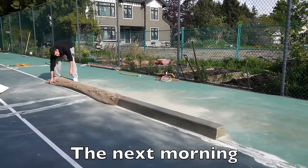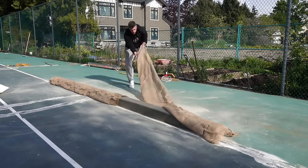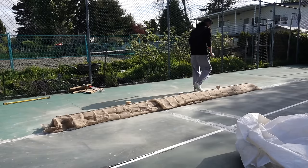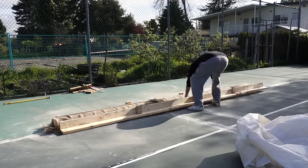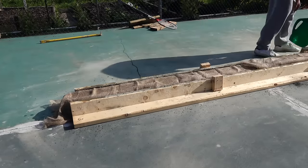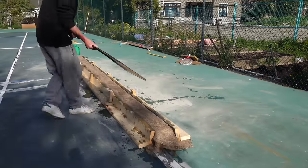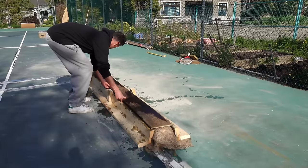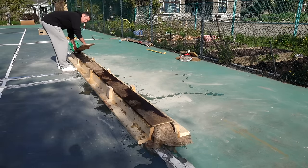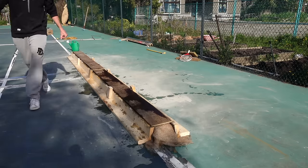Now just hold your horses — it is not ready to skate yet. The next thing you need to do is cure the concrete. I need it to be as strong as possible, so we are going to give it a 30-day water cure. The burlap is going to help hold the moisture in, and I literally did this for 30 days — watering it every single day and putting plywood back on top so it would stay wet. Concrete does not reach its maximum strength without remaining wet for 30 days. For architectural concrete this level of curing is totally unnecessary — you really just need to keep it wet for about a week, or just spray some water on it a couple times a day.